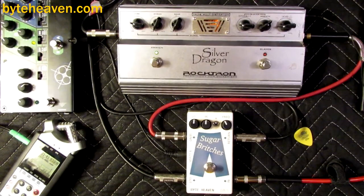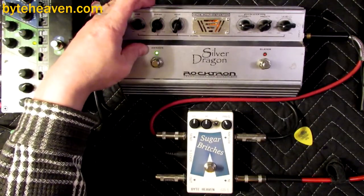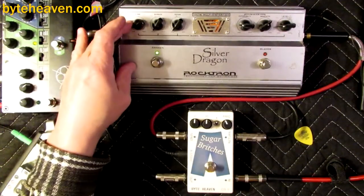— because the tube stage is driven with that low-frequency roll-off, and then you get some of it back with this weird EQ stage that's sort of a treble-boost, mid-bass-boost circuit. So with knobs almost all the way down, it's almost flat.